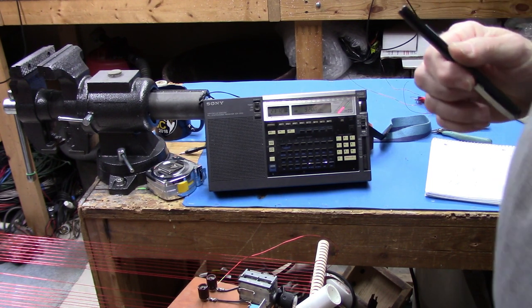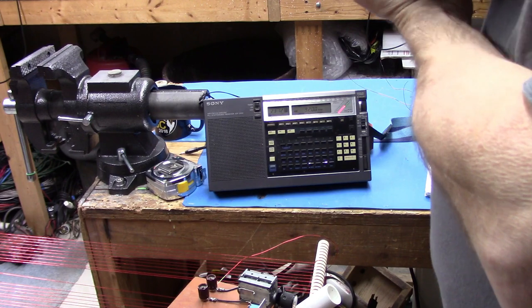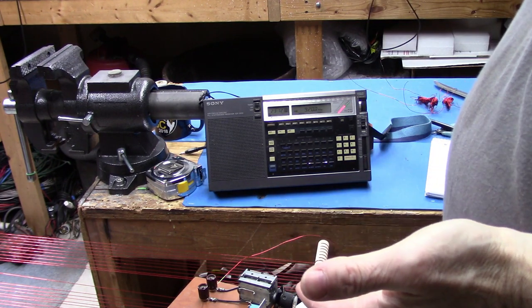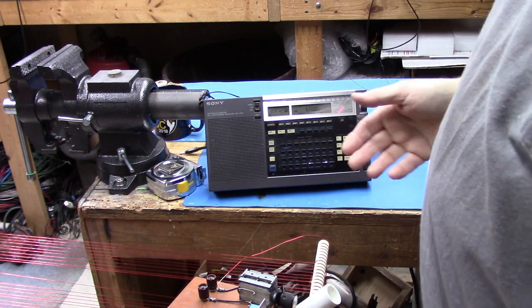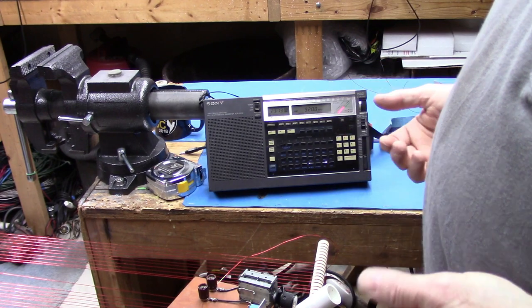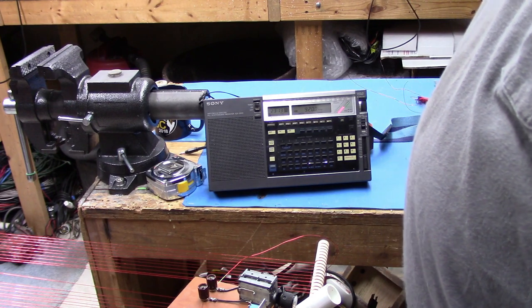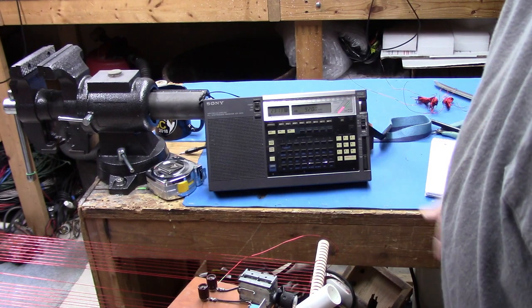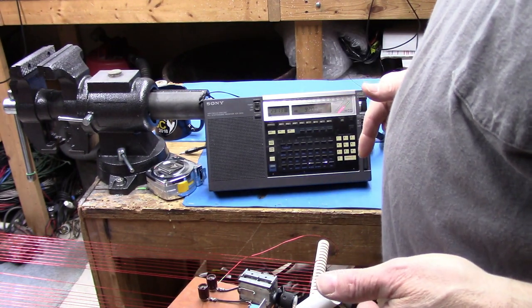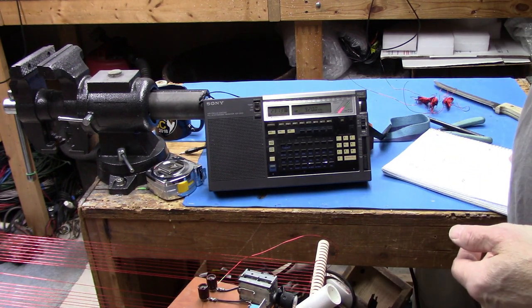Now, I'm not doing this for my health. I'm doing this so that you can see that if you build big, you can make it smaller. If it's too small, you could easily solder onto one of these wires and continue winding. Remember those 50-in-1 kits you used to be able to get from Radio Shack? It's an experimental platform. So maybe if you made these 3 feet long and you had a place to put a loop that big, you can get this to resonate at 100 kilohertz without any problem. So, okay. All right, back to the task at hand.